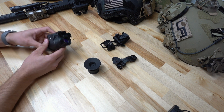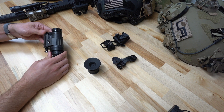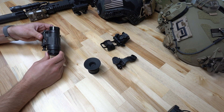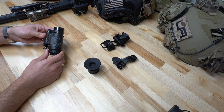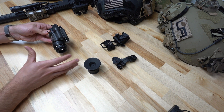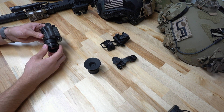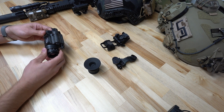Overall, they're a super high-performing system. They use what's called a 1610 tube, the same tube that's in PVS-31 Alphas. One thing that's nicer about that is these tubes come standard with a stricter halo spec than most tubes. Most mil-spec and even aviation tubes on the market have a max halo of 1.0, but the 1610 tubes in the 31s and M914 Alphas have a maximum spec of 0.85 on the halo. That is a stricter spec and a nicer halo value on the maximum side. You can absolutely get lower than that with these tubes, but you really have to buy night vision off the minimum and maximum performance specs. So if you're wanting a stricter halo value, this is a good option.